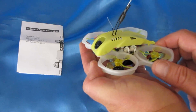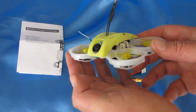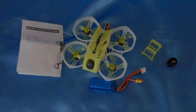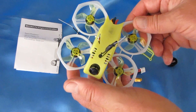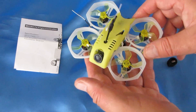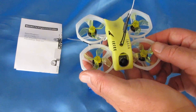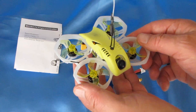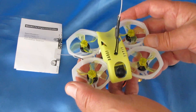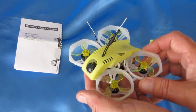This drone also has on-screen display. The flight control board is an F4 flight control board loaded up with Betaflight 3.53, dated November 18, 2018 — not the most recent version, but a reasonably new version. It has on-screen display with smart audio capability, meaning you can change the channels and adjust the PIDs using your goggles in combination with your controller out in the field.